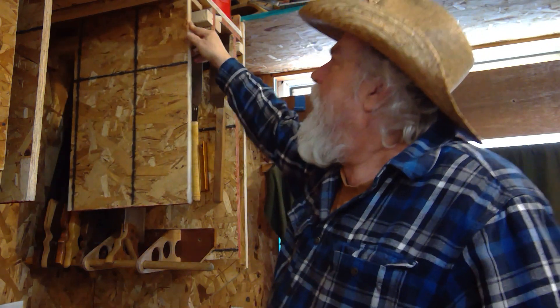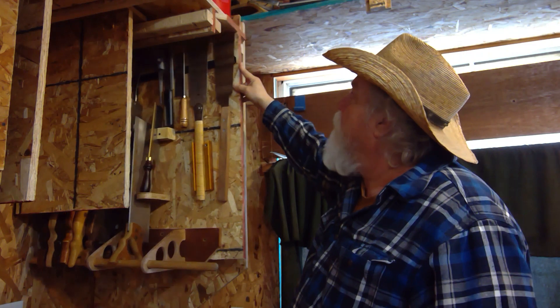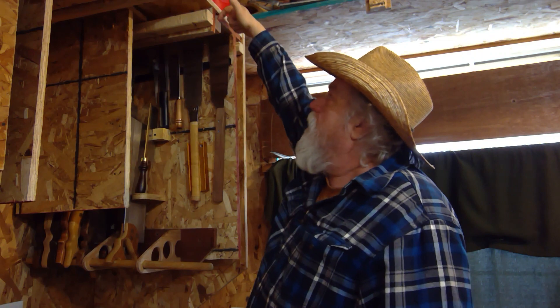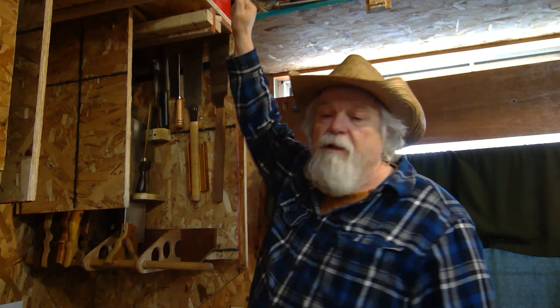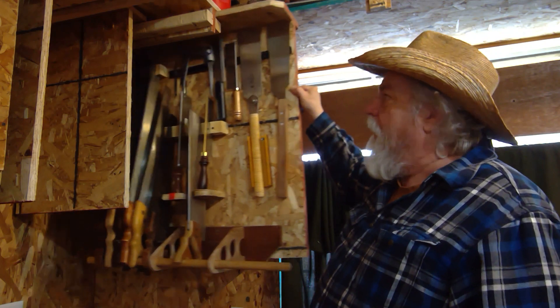On here with all the planes, one thing I've noticed since I put weight on this is that I get a little bit of roughness off those bearings — those glass marbles. So I think maybe it'd be worthwhile, as I'm going to change up this OSB on this top plate that rides on the marbles, to take that and replace that piece of OSB with some melamine. I think that would probably work better and run a lot smoother. It works, it's just kind of rough when I pull it out.